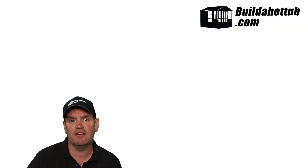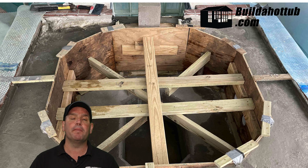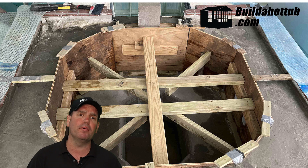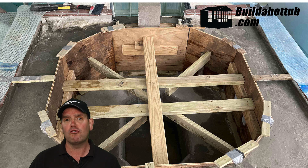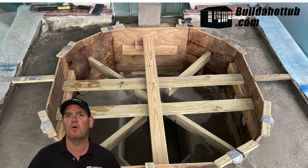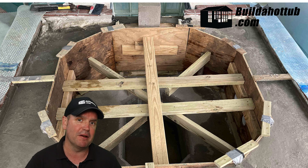With all of the plumbing finished, and Mark actually pressure tested it as well — nice job, Mark — it was time to actually form up the top of the seats and do the main pour. And you can see behind me here, this was quite a big pour that Mark has done. There's loads of bracing in there because concrete is heavy and we want nice perpendicular walls — we don't want walls with bends in. So brace, brace, brace, and more bracing, please, when you are forming up concrete walls.